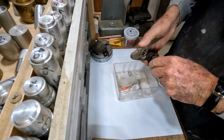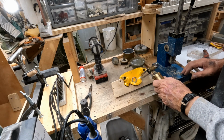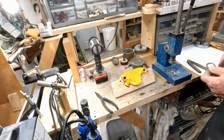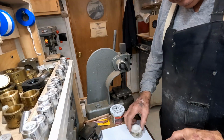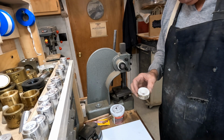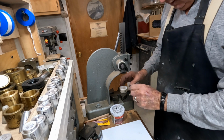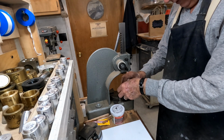We're going to deburr this thing. This is the annealing process. Silver gets work hardened as you bend it around. Now we've got a little 25-degree die, that homemade one, and a pusher, both made out of Delrin. And we're going to put this blank in the die with the detail turned down. That's the part we want to be the outside.